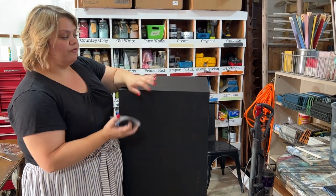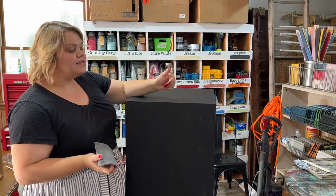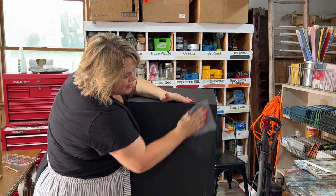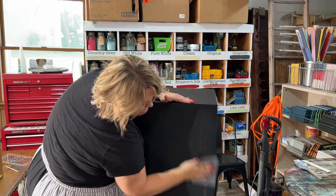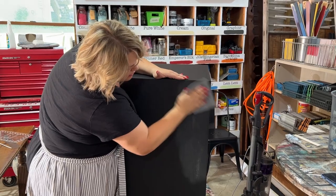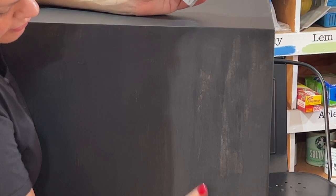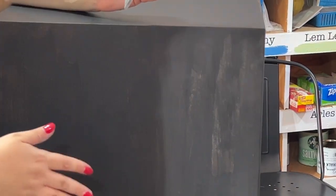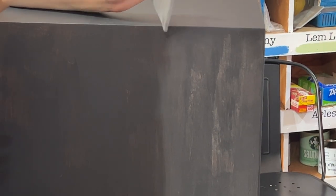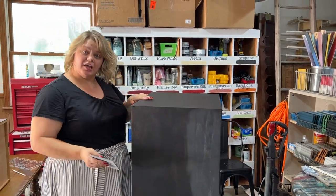Before we put our second coat of paint on, we're going to sand the problem area with a light sanding sponge — a fine to medium grit, or this 220-grit — just a light pass. We'll sand all the rough paint off, then you can re-clean it and try painting again, or put a layer of shellac on there before you paint the next layer. So we'll do that, then put a second coat on, put all the drawers in, and show you what it looks like.